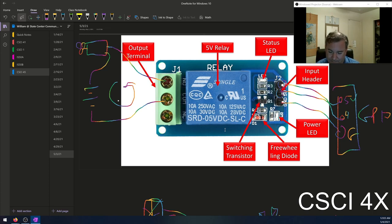The only caveat again is if, when you're looking at the SunFounder site, it says you need an analog to digital converter, you can only have one of those without purchasing additional stuff. So don't attach two analog sensors. Attach one, max. You can do zero, I guess, if you want. Because that needs to be hooked up to the I2C port.